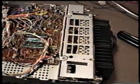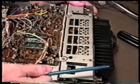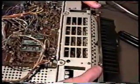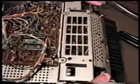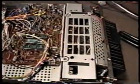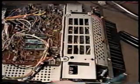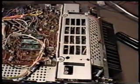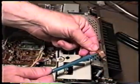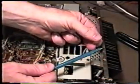Okay, we've gone ahead and removed those screws that I previously pointed out in those locations, and now you can see that this will just freely swing back. Now, there's one thing that's going to happen if this radio has never been opened up before. When you swing this back, you're going to maybe see something fall out, and it's going to look like this. This is a little copper strap